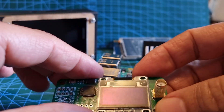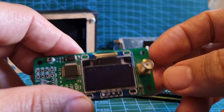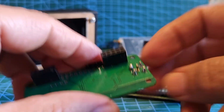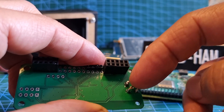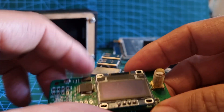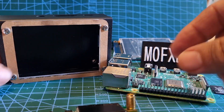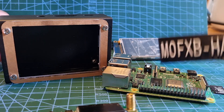The idea is we're going to get a hat, but we actually need a hat that hasn't got an OLED or antenna, because we're going to solder a very small piece of wire to the core of the antenna and then attach something — it could just be hanging inside, or I'm not sure if there's room to put it in that box.